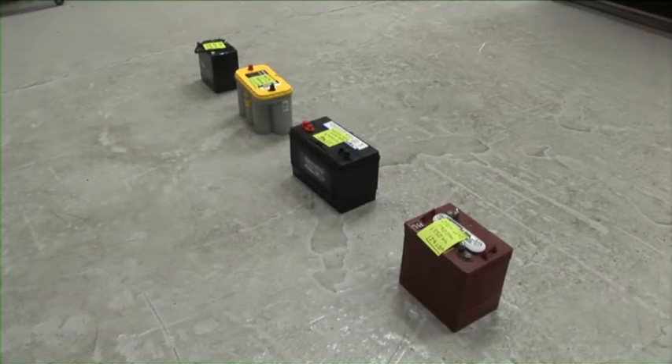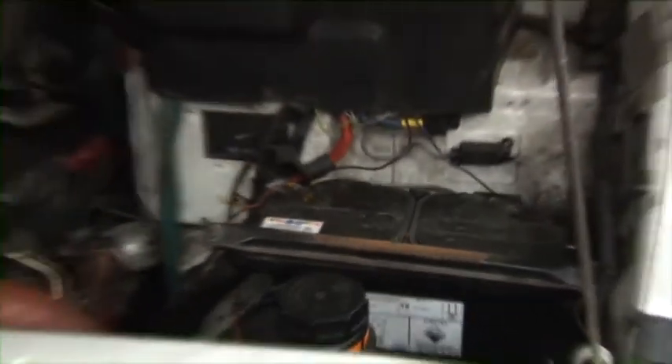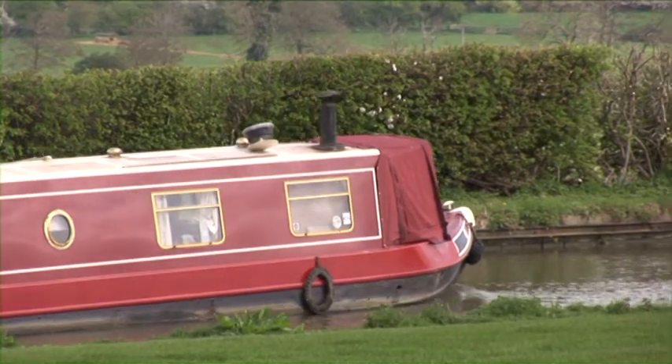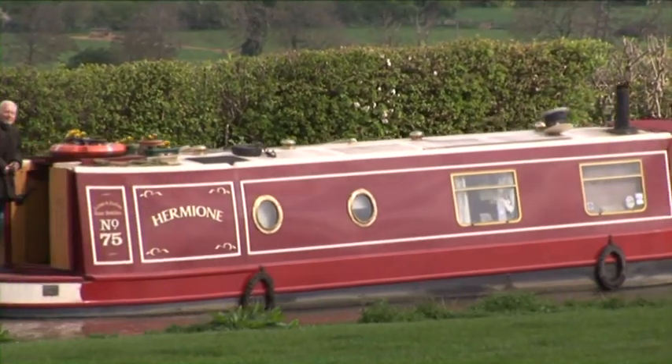A lot of these exotic batteries are sold on the premise that they are maintenance free. Maintenance free derives from approximately 20 to 25 years ago when you had to top up your battery in your car. The battery companies realised - let's put an inch of extra water in the battery, put a lid over the top, and call them maintenance free. But when you go on to the domestic battery system on a narrowboat with deep cycling and fast charging, the term maintenance free no longer applies. I like to use the term 'unable to maintain' instead.